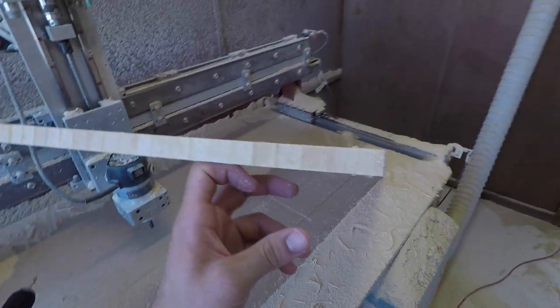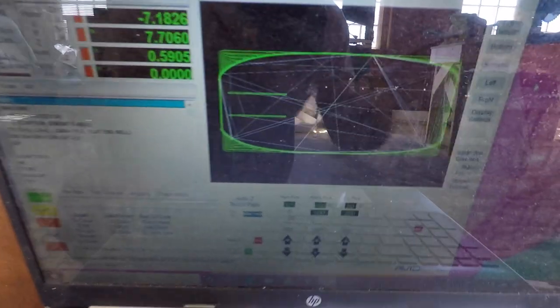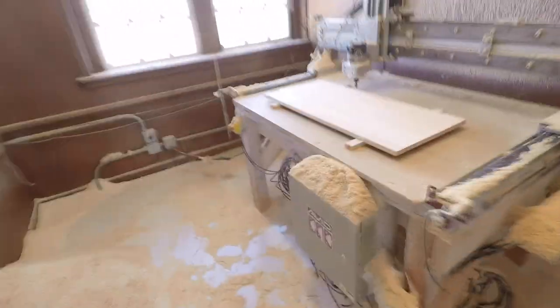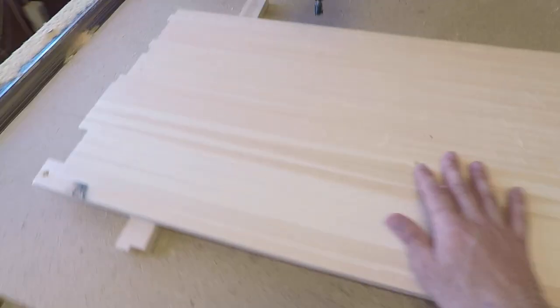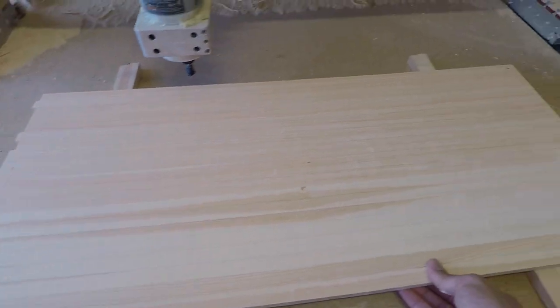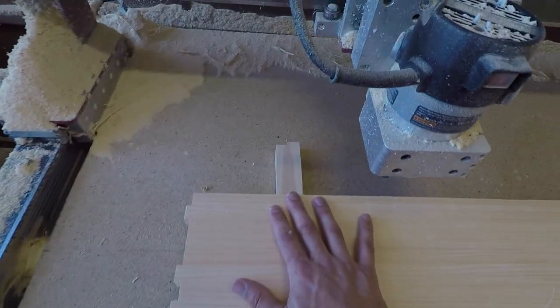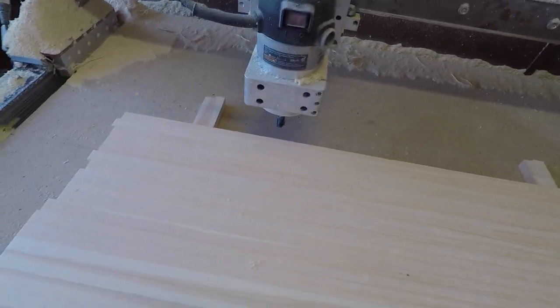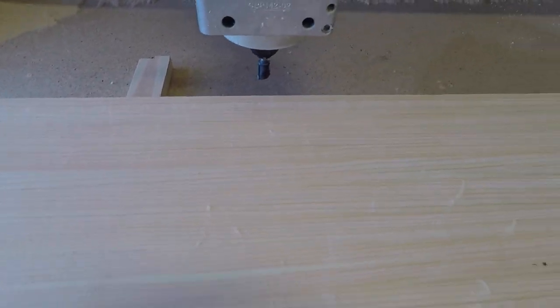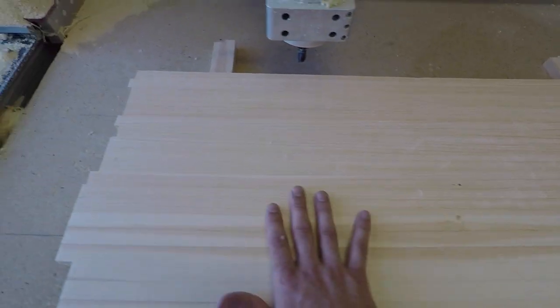Now that it's perfectly flat, I have the board program pulled up. It's been flattened on both sides and taped down with double-sided tape — seems to be on there pretty well. I'm going to slow down the router a bit so there's not too much force on it, and we're going to get the bottom side of this board shaped.